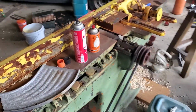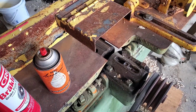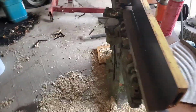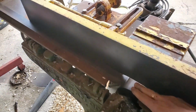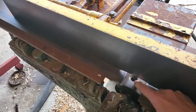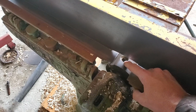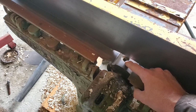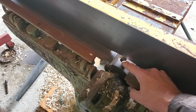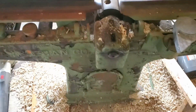It was a little rusty on the bed, but the cutter head, it's Babbitt bearing. It's a 2-knife cutter head. One of the knives is setting high, so when I'm joining boards, it's actually only hitting on one of the knives. It's got a very unusual 0.41 square recess in the gib screws. So I have to make an insert for the socket wrench to be able to take those knives out.